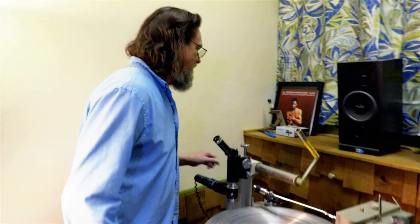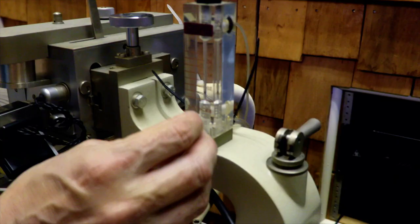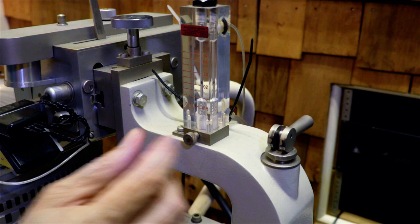I have a tank of helium and a tank of nitrogen back here, so I've got to turn the gases on. The helium goes into this apparatus here, and I control how much or how little actually goes through this tube and feeds the cutter head.